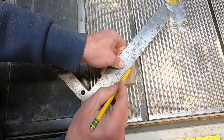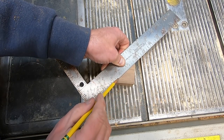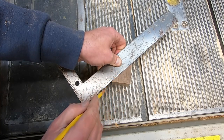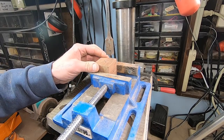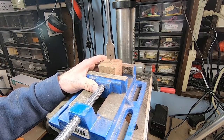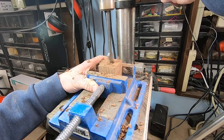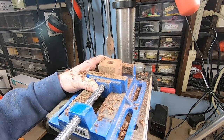Locate the exact center of all six sides by drawing a diagonal line from corner to corner. I'm using a three quarter inch paddle bit, not drilling all the way through, but rather a little over halfway. Drilling a hole this way on all six sides will clear out the middle where the quarter will end up.